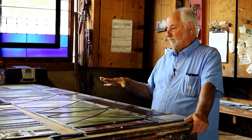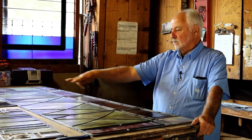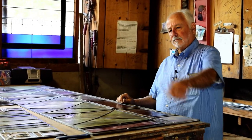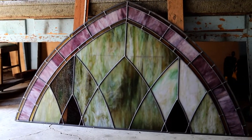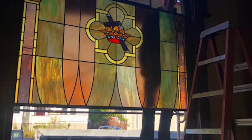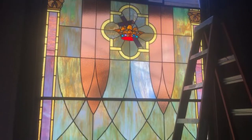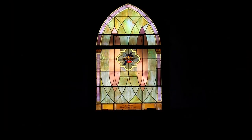Of the large window, this is the bottom, these are the sections in the middle towards the top, and the top part is over there. This is the large center part she's working on right now — this is one window. On site we have to clean out all the frames, which are mostly wood — redwood — but also there are some metal T-bars splitting up some of the panels. We clean them all out, then stack these panels one by one into the original frames, put caulking, put the window in the panels, do more caulking, and put the wood stops or putty. Then we put the clear plexiglass back on the panels to protect them. That's basically the process.